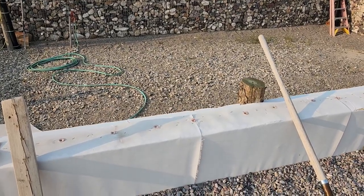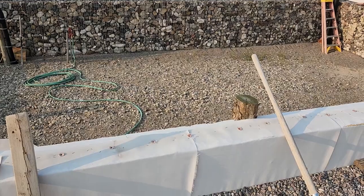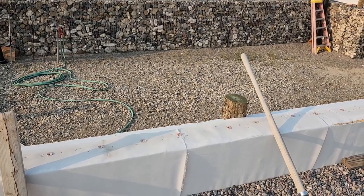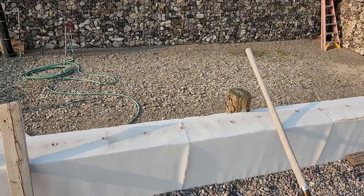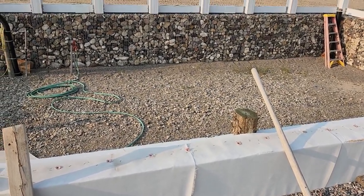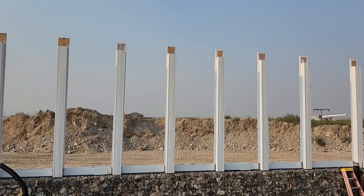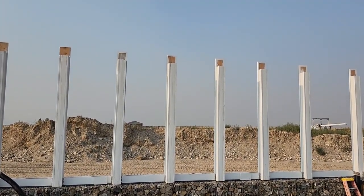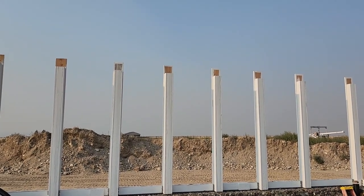We're at the south wall location now — this is where the bottom of those web trusses will be anchored. We'll be using angle brackets to help support the trusses as we install them. The top of those trusses will rest on the header — the sandwiched two-by-twelves — and we'll anchor them up there as well.